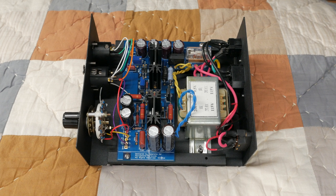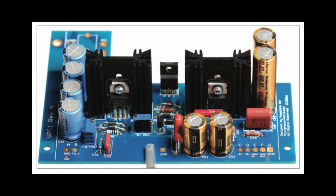There are two options for the power supply. First is the pre-made power supply that Mic Parts QC tests before shipping. You'll need to swap out two parts in this to optimize voltage output. The second option is an upgraded MOSFET regulated power supply you build yourself. This one has lower noise, no voltage drift, and improved filtering. I'm of the buy once, cry once mentality, so I sprung for the upgrade. I purchased my kit in December of 2020 and since then there have been some upgrades to the VPS power supply. Here's a look at the current version of the VPS — the filter caps have received upgrades and some parts have made the switch to Mic Parts proprietary Roswell branded parts.